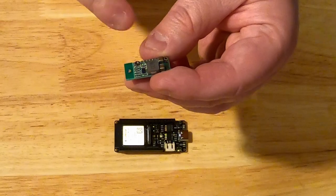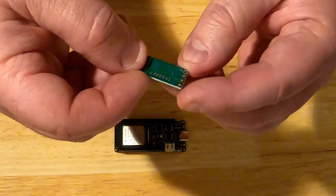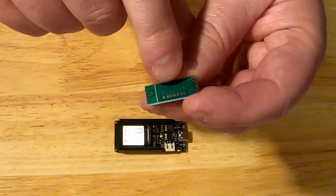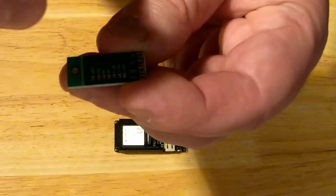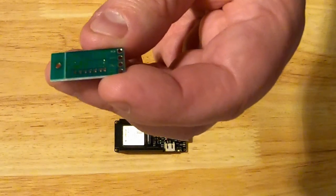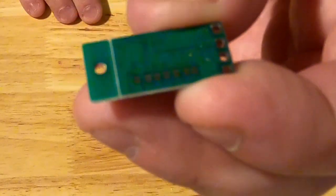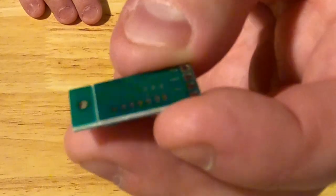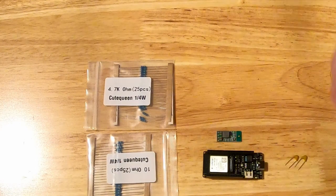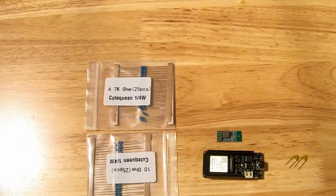The 12 volts come in here and then out goes a voltage. This particular one I wanted to try because not only does it have a potentiometer where you can set whatever voltage you want, but it also has jumpers on the back. You can solder between one of these lines and cut the other connection to get a set voltage — there's a 5-volt output right on the back. I'll solder across there and then cut the connection to the potentiometer.